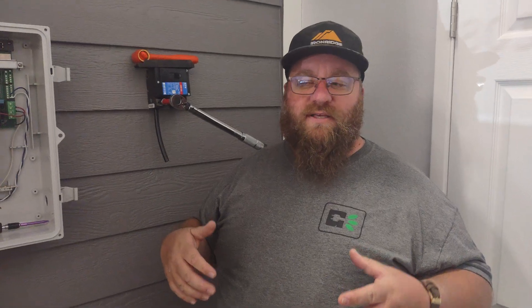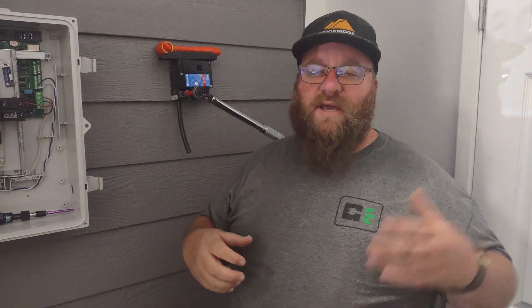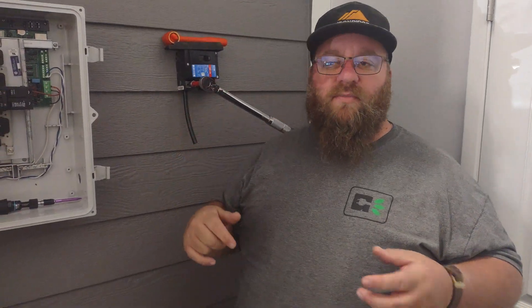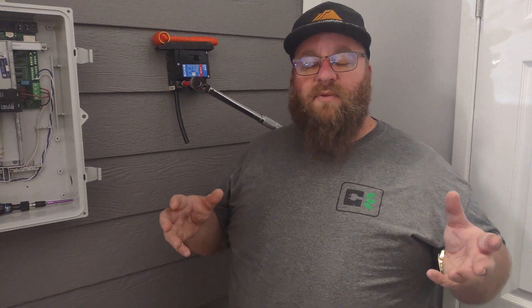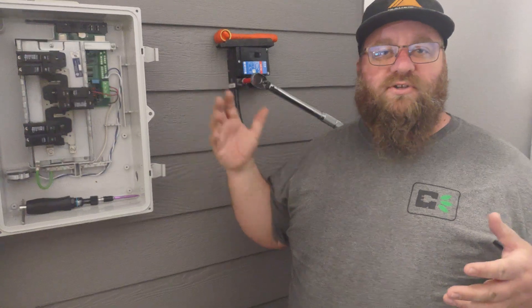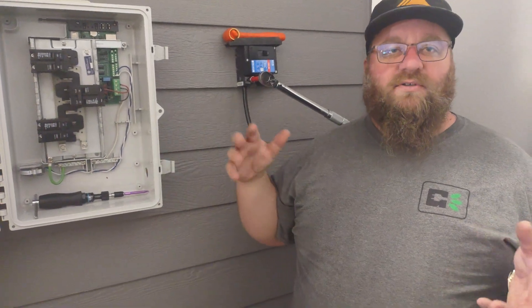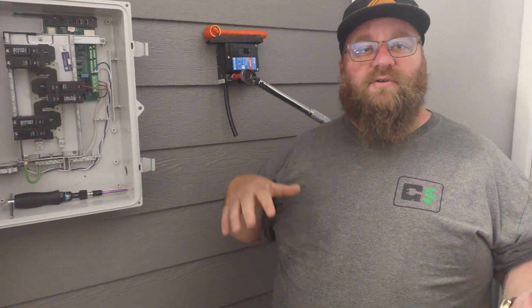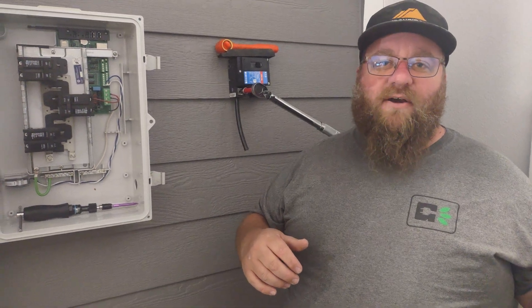You're not allowed to do it by feel — thinking it's close. That can either be too much, causing problems with the breaker or stripping out the bolts, or too little, causing arcing issues. This is probably the number one arcing issue I come across: a panel that's been under-torqued, or where they didn't use a torque wrench and left the lug undone. We'll usually start seeing breakers tripping, arcing, and sparking. So this is one of the first things I check when I see breakers tripping in the panel. Check the description below for the codebook reference. Remember, this is a review video, not a training video. The equipment we use here is what we have at our facility — you may use digital torque wrenches, and that's fine too. Torque tools do have to be certified every year, so make sure they're being recertified or repurchased annually. Be safe out there.